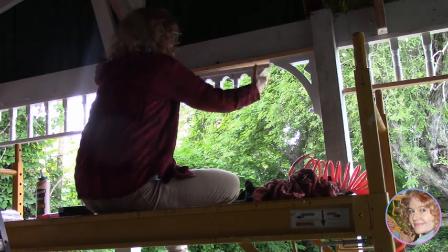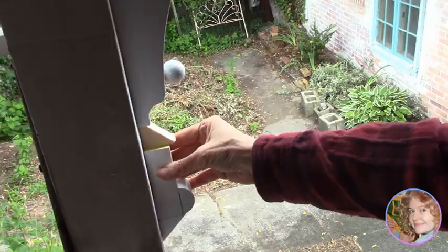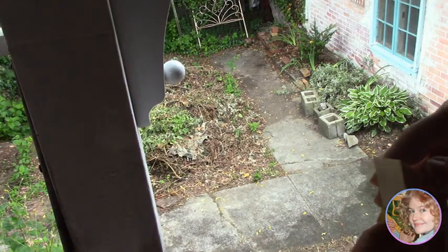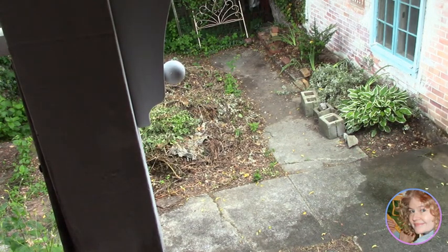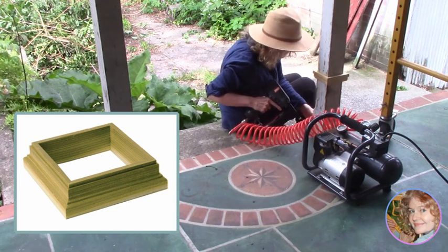Now we're going to attach the centerpiece using both glue and nails. And since it fit tightly between the brackets, it held itself in place while we attached it. And now the lower trim, and last of all, the cylinders, which we glued and taped, and we shot the nails right through that tape, and the installation at the top was complete.